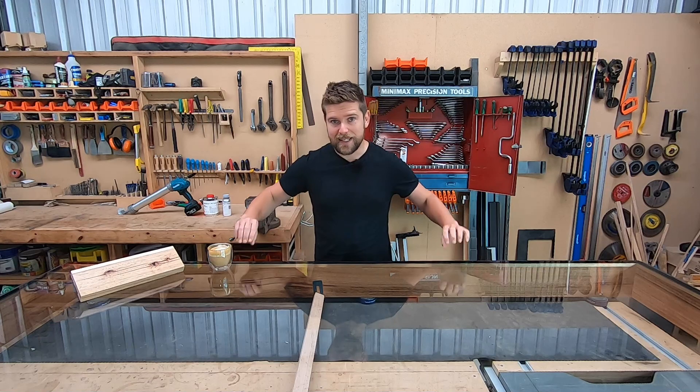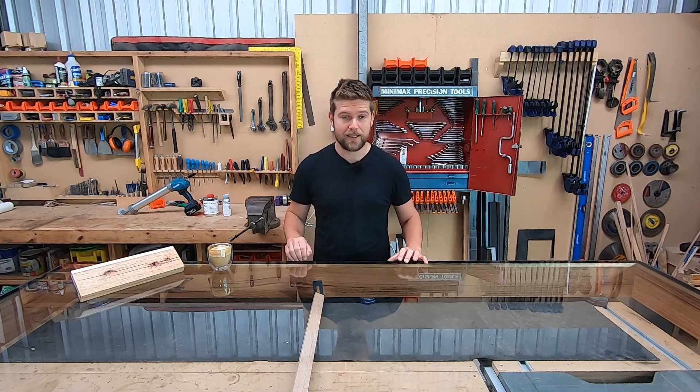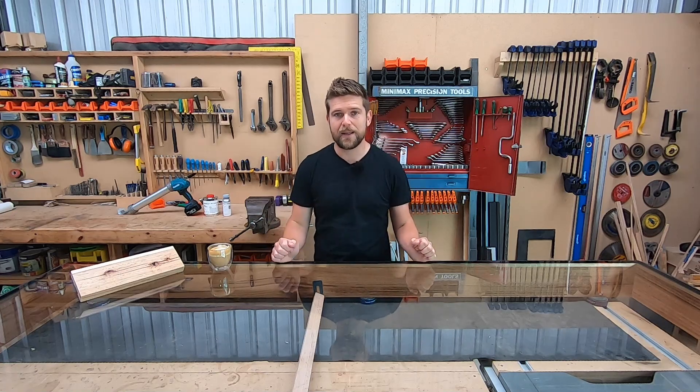Second, because the glass is going onto the face of my window frame, the adhesive ends up being exposed to UV through the glass. It's got UV directly hitting the back of the adhesive, which creates problems with degrading the adhesive.